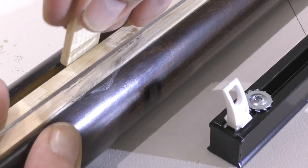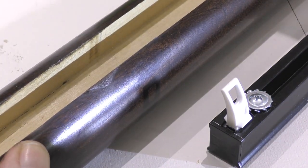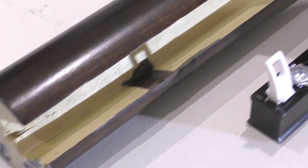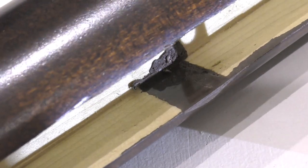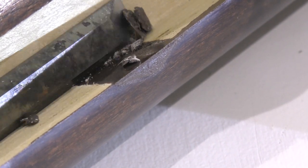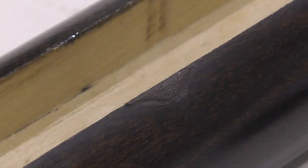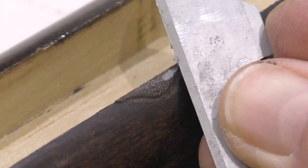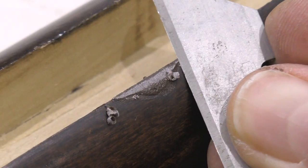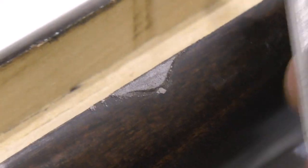Right, the filler's gone hard — it's about five minutes after I did it — so I can now take out the little packer piece I put in, revealing our neat little repair job. Look at that shiny finish — I wish I could get that shiny finish on the front, which is where I really need it. I'm just going to trim off that little bit of excess filler at the bottom. I don't really want to sand this, so what I am going to do is, using a Stanley blade, I'm just going to very gently scratch away, trim away at the surface until the filler that I've just added is completely flush.